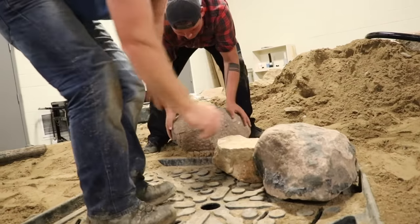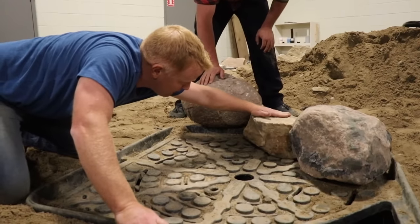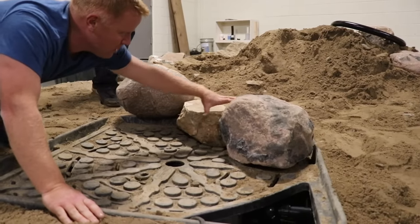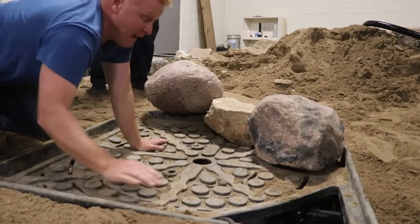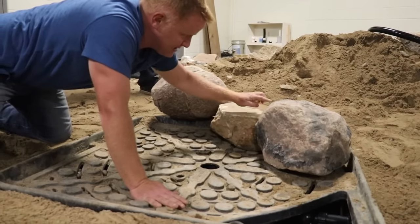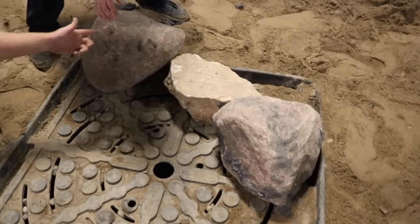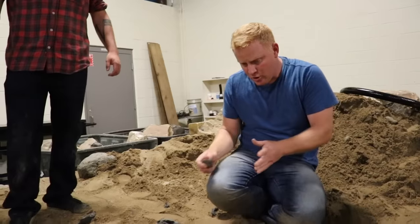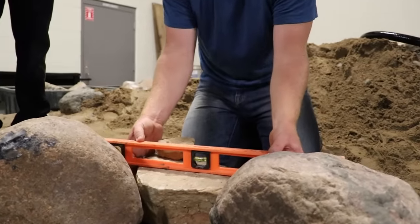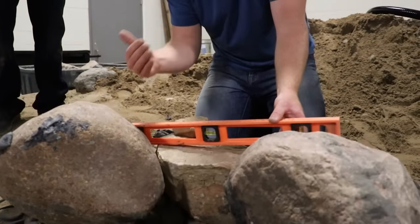You're choosing your frame rocks right now, Brian? Yeah. What I'm looking for is a rock where water has to come over it and drop down — something to confine or keep the water into a certain area. I like this rock for the angle and shape of it; it's higher than the surrounding stones so all that water should come around it and drop in. It's super important that your spillway stone should be level side to side. If it's leaning left or right, that's the side the water goes.